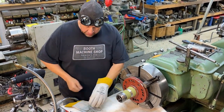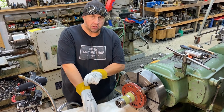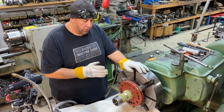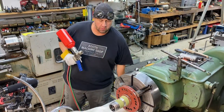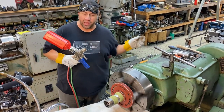All right, guys, it's time to start getting this thing sprayed. Shouldn't take very long. This is a pretty small buildup. We'll start with our preheat. We got to get it preheated to at least 200 degrees. And I'm going to do a base coat and then make an adjustment on my transport valve. And then we'll do our final buildup coat. Okay. Make a little pop right when we light off right here.